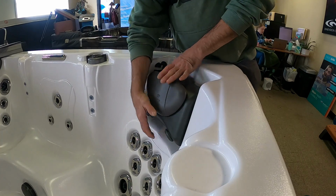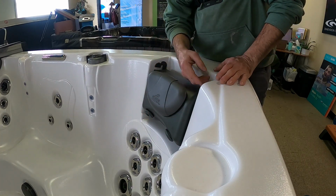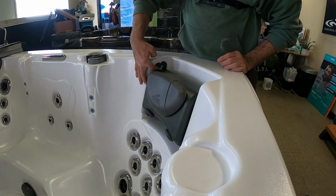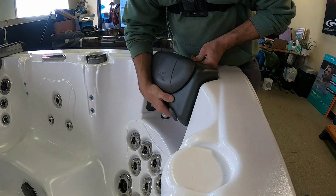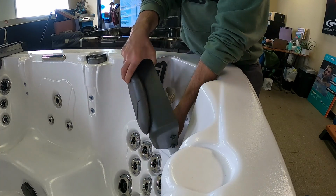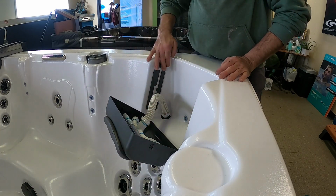By pushing your headrest all the way down, you can actually see the headrest rails and see how they work. At the top of the headrest rails, there'll be an opening area there, which your pegs for your headrest will come to that point and slide out, and then you can just kind of jockey your headrest and angle it out of the headrest rail.